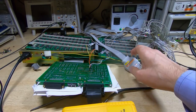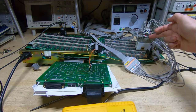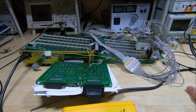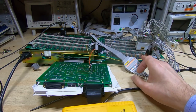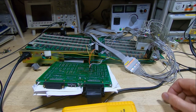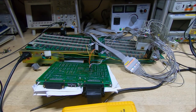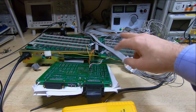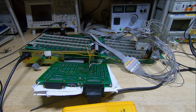But of course you have an issue here: we're trying to run a CPU, and this is the CPU, the Z80, that we've got this clip attached to, and that's the one that effectively resides within the target system, but it also has to run the emulator. It needs memory to run, so not only does it need to access ROM, which is fine, it can just be mapped in and out, but you can't map it in the standard way because it has to run seamlessly. So it has to be memory mapped. You can't use I/O mapping, otherwise you'd have to write special code to switch between the different banks, and obviously if you're running the code on the target system you can't do that.